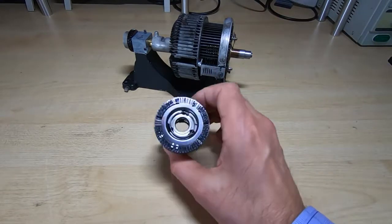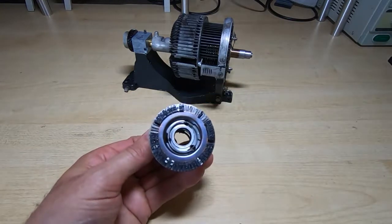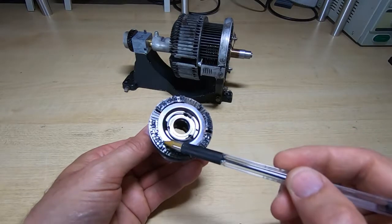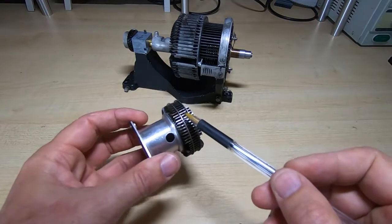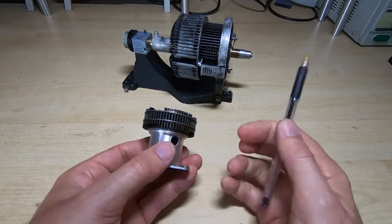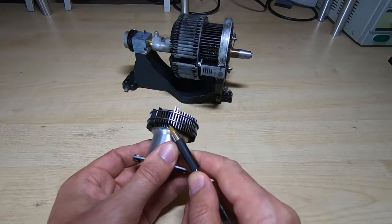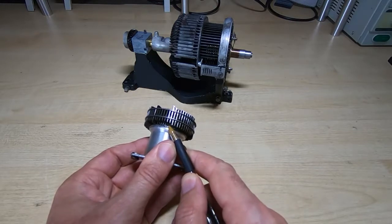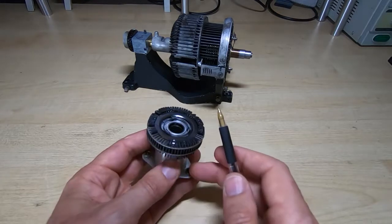This is the actual print head, and as you can see it's very similar to a daisy wheel printer in that there's a disc where there are a series of pins, and each of these pins has one of the printable characters embossed on the end of it. And the printer works by forcing these pins out individually onto the paper, and obviously it impacts the paper through an inked ribbon, and that's what transfers the character to the paper.